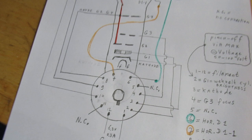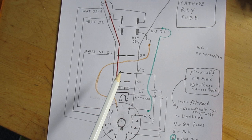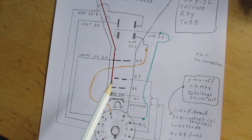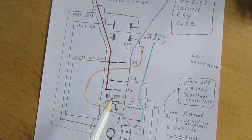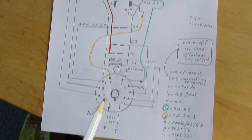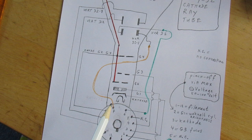And often you see, when you study data sheets of cathode ray tubes, always the name that this is called a grid. But in reality, it is no grid. It is in fact sometimes, at least for the Wehnelt cylinder and other cylinders, a cylindrical grid in some cases. You can study that further. I cannot go too deep into that because I only have 15 minutes on my camera. So often a grid is named a grid, but it is a cylindrical grid to focus the electron beam.